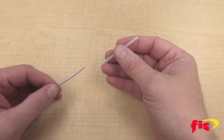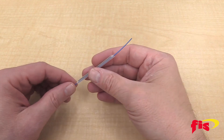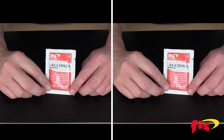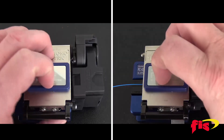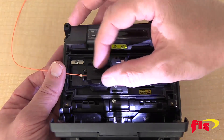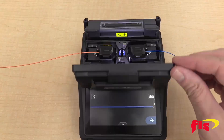On one of the fibers, put the 60-millimeter splice sleeve on before splicing. Then take two pieces of single-mode fiber, strip the jacket and remove the acrylic coating, clean with isopropyl alcohol, and cleave the fiber. For fiber-to-fiber splicing, it's important to cleave to the standard length of 10 millimeters. Place the fiber past the blue pad of the V-groove, but not past the electrodes. Close the lid.